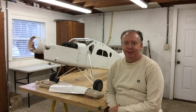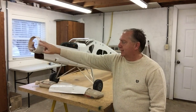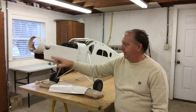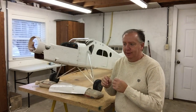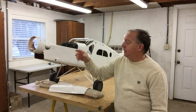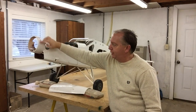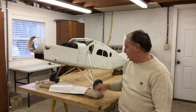Hey, I'm Mitchell, welcome to my shop. If you remember last video, we just finished hide glue on these two pieces. It's not been quite 24 hours so we need to let that sit a little longer, especially when you're doing large sections of hide glue. It has a tendency to set up on the outer edge, but in the center where the air can't get to it, it takes longer to dry. So we're gonna leave that alone.